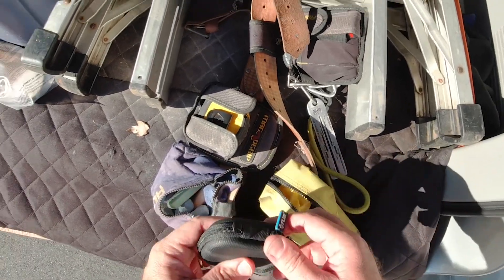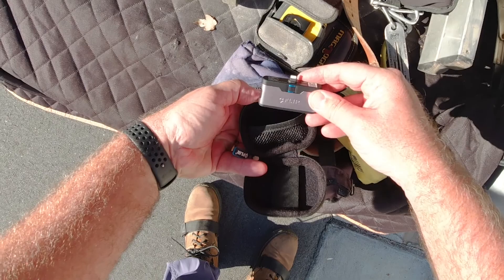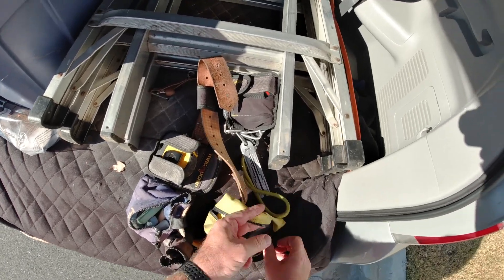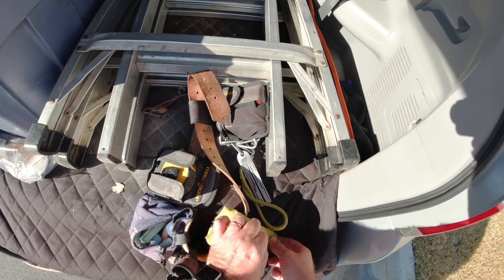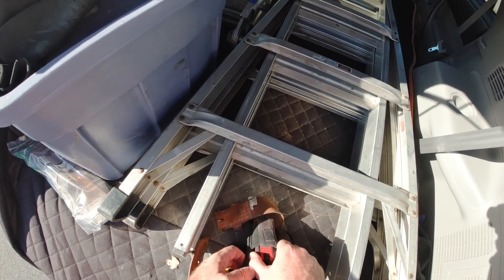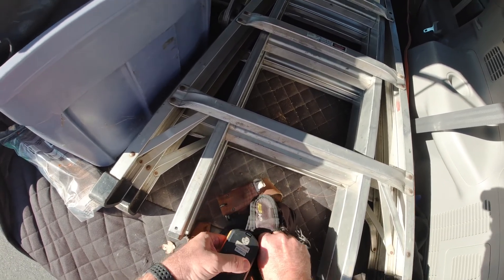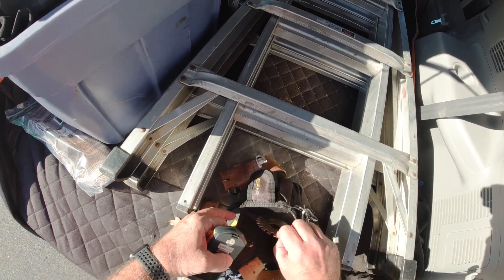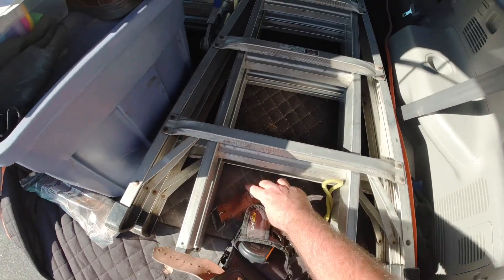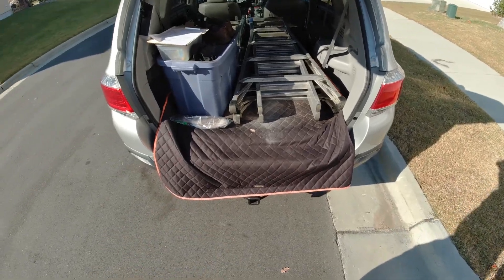This is my FLIR — it's actually an infrared scanner that hooks on the bottom of my phone. Definitely want to get one of those in case you need to do infrared for water testing; it's ready to use if needed. It's mainly used to see where water is moving through. I've also got a moisture meter, a Leica tape measure, a metal gauge for metal roofs, a thickness gauge, a shingle gauge, and a bungee for sticking on the roof. I put everything into a big tool belt, kind of like a carpenter's tool belt, around my waist.